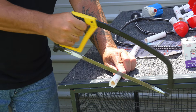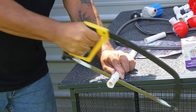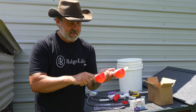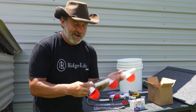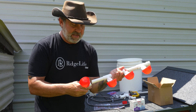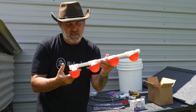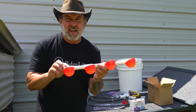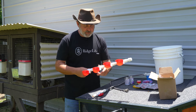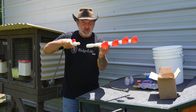I need to cut a small piece for the cap on the end — just a piece to keep the flow from coming out. Before you put any cement on, you want to make sure you dry fit everything and get everything lined up. Once I'm sure everything is done properly, then we can put the primer on. The primer is very, very important — it makes that PVC glue seal perfectly. Make sure everything is level and lined up, then you can glue that section together.